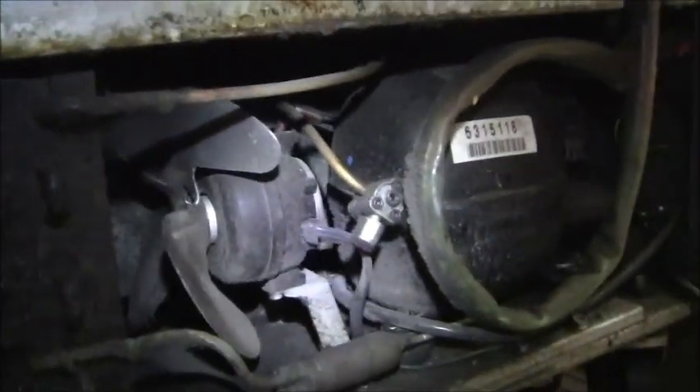Here's the next one — there is that coil and there is everything else. Here is the next one and you can see how nasty that is, really caked on — there's that coil right there. I've got that one unplugged. This one here I didn't have to pull off the panel because the coil was actually exposed, so I'll get in through here and in through the other side as well. I'm going to go ahead and start vacuuming then blow it out.